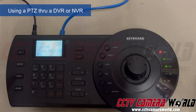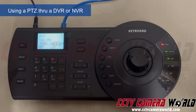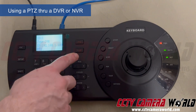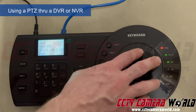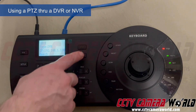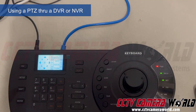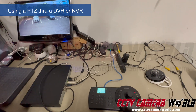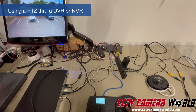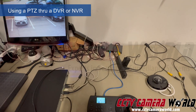To control a PTZ through the DVR, you need to do a couple of steps. First, tap the Use button. The PTZ channel in this case happens to be channel 5. You type the channel number of the camera you want to control — channel 5 — and then click the PTZ button. Now you're in the PTZ menu that you saw when accessing the camera directly, and using the joystick you're able to control that camera connected to the DVR, either through the network or directly.